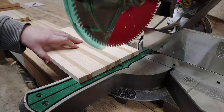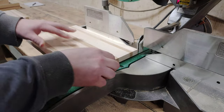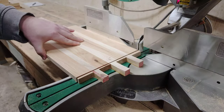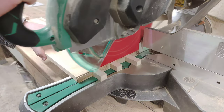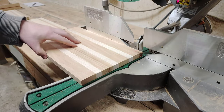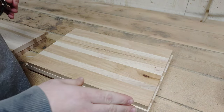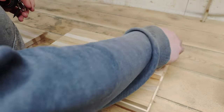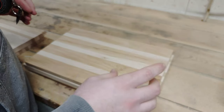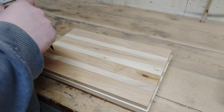That's what your miter saw should sound like — stop taking little passes. It's a 15-amp tool, use it. If it's not getting good enough cut quality, buy a better blade. Taking little passes is meant for breaking down rough lumber where there's tension and it hasn't gone through a planer yet. That is not how you get a finished quality cut on the edge. You can tell I'm passionate about this — a lot of people on Instagram and YouTube don't really understand what they're doing or why.